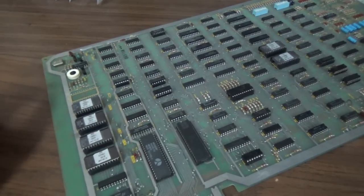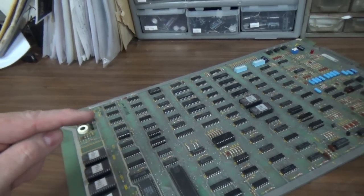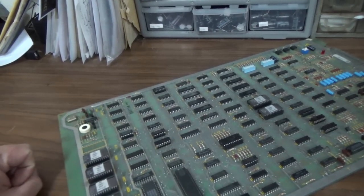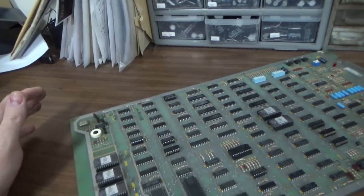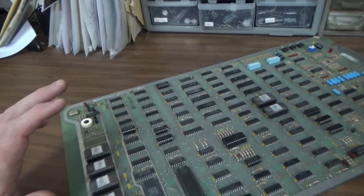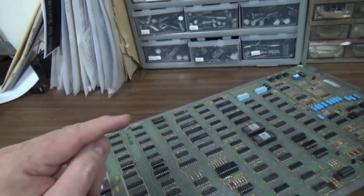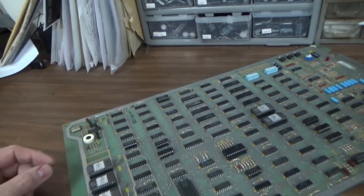And then there is also a clock signal. So the information that's stored in these EEPROMs and just the logic and everything that it's running, for it to send those signals, it needs something to provide that timing, right? It's like surfing. If you're a surfer, if you go out in the water and the water's just completely stagnant, you can't surf on a lake very easy without something to make waves or to make movement, right? So the clock circuit provides that movement. So it sends out a steady clock, and then if this wants to turn something on, it can turn it on for a little bit of that clock, and then turn it off, and then turn it back on. And so it uses that clock signal to make all of the stuff work.